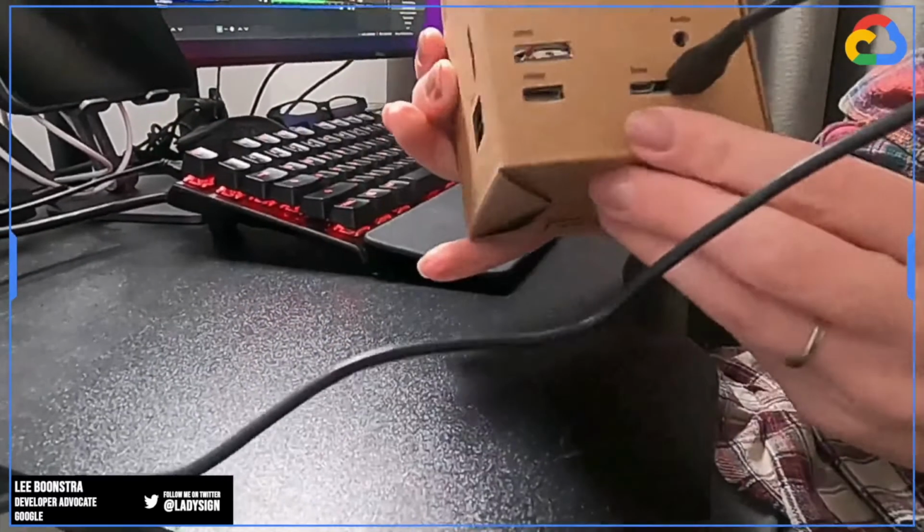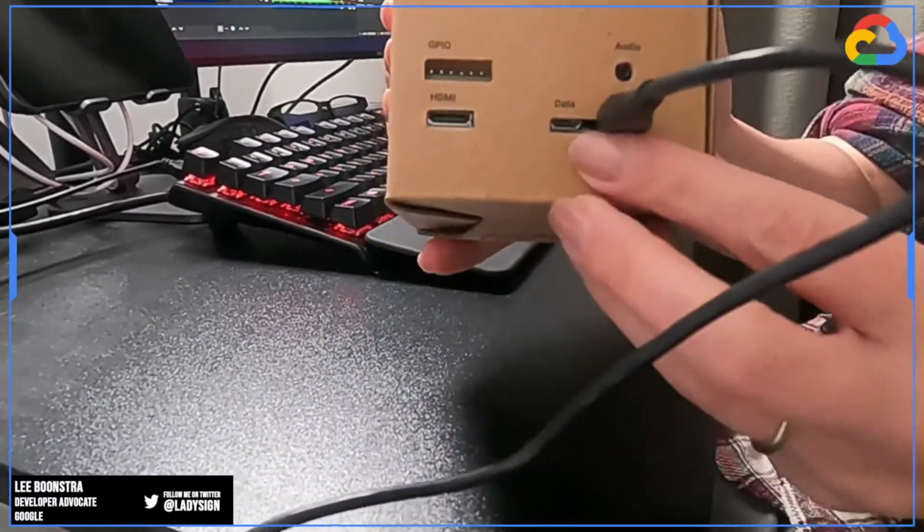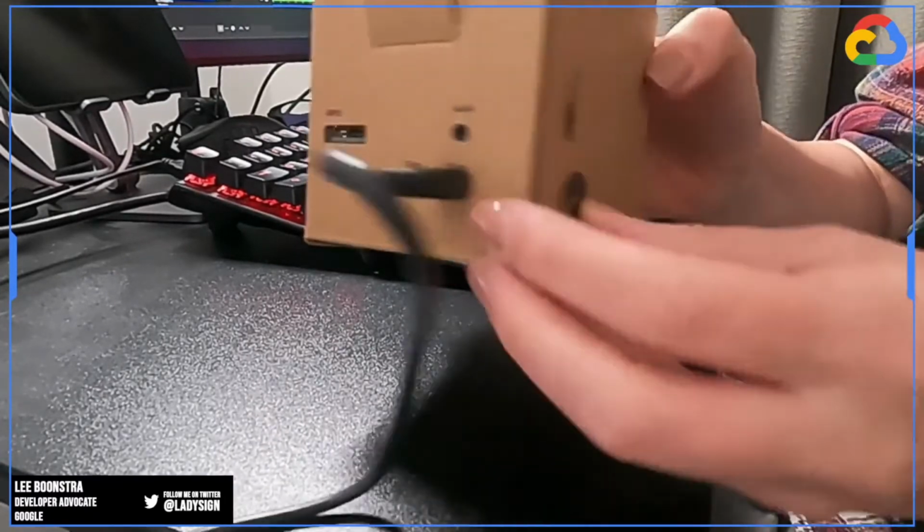If you think this is all too difficult, you can also plug in your keyboard, mouse and monitor. There is an HDMI connection in the cardboard and another data micro USB connection. That means you will need an adapter that uses micro USB and probably a splitter that creates multiple connections for your USB keyboard and USB mouse. I don't have this equipment with me. I think SSH is easier, but we will write some Linux commands on the command line. But I'm going to show you how, so it's not that difficult.